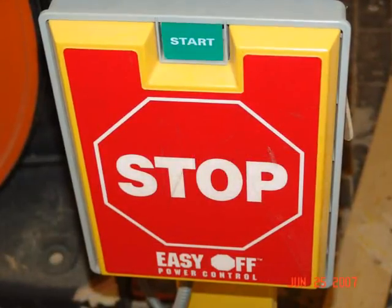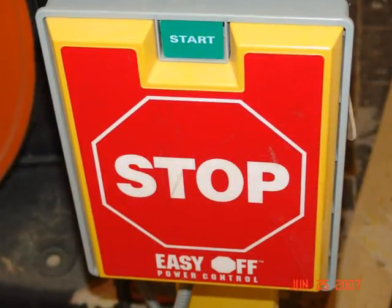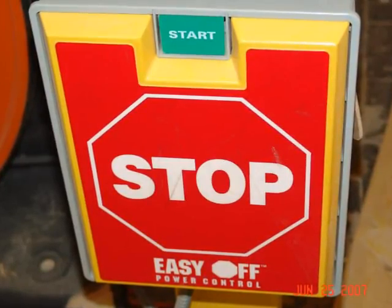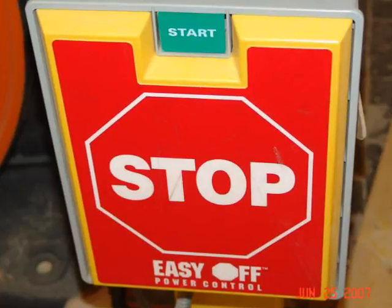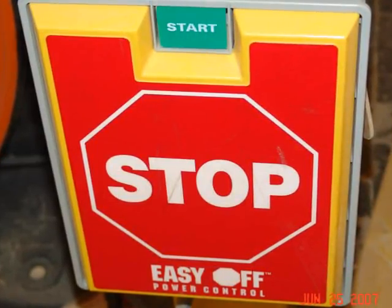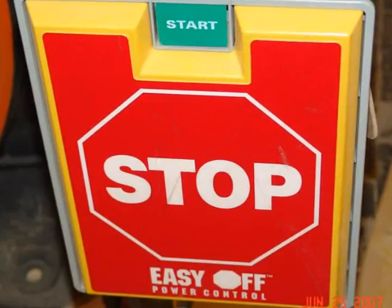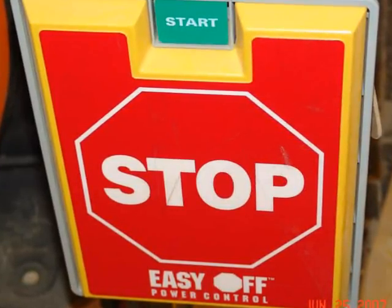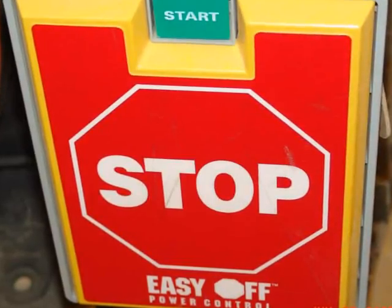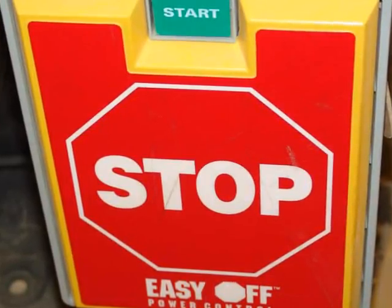No adjustments should be made when the bandsaw is running or in motion. Thin stock must not be stood on edge to be cut, unless it is firmly supported by the resaw fence against the downward thrust of the saw blade. This is not permitted at John Marshall High School without special permission and additional instruction from the teacher.